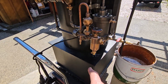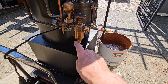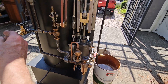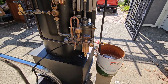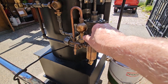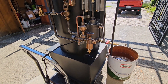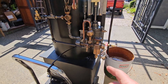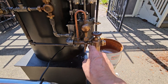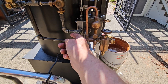So to drain this, you turn off the steam, you open this valve and drain the water out. How much water comes out of it is about how much oil you've used. Unscrew this with the steam off and open the cap, and the water will drain out of the bottom. That's how much oil you've used — just fill it back up, put the cap back on, and tighten this valve down. Steam comes into it, pressurizes the tank, and pushes the oil out through these valves into the engine.